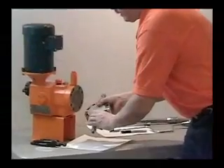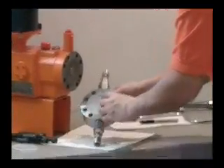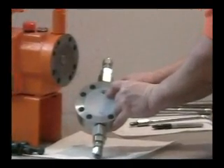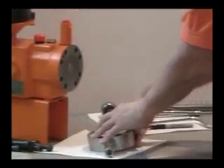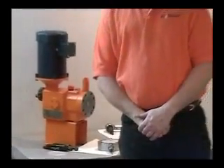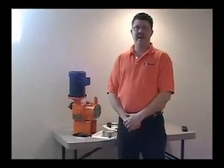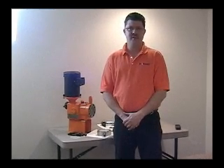If there is a rupture in the diaphragm towards the liquid end side, the diaphragm will look like something like this. This is usually caused from over-priming of the hydraulic system. If the pump runs at 100% stroke with no back pressure for long periods of time, or after replacing the diaphragm if the priming procedure is not followed correctly, it is possible to over-prime the hydraulic side and almost immediate failure will occur when the pump restarts.